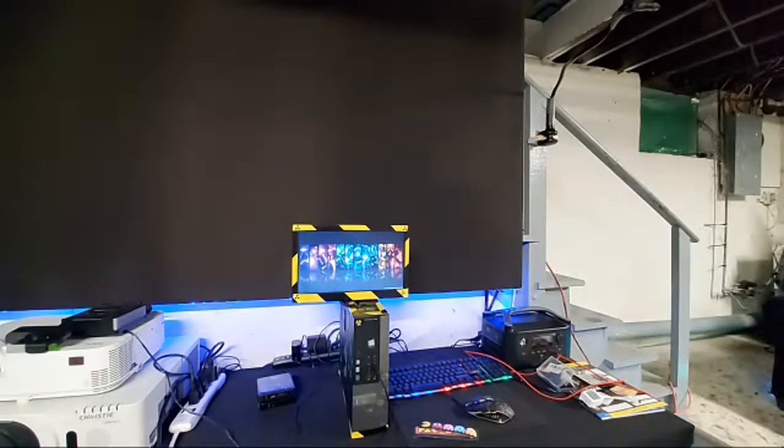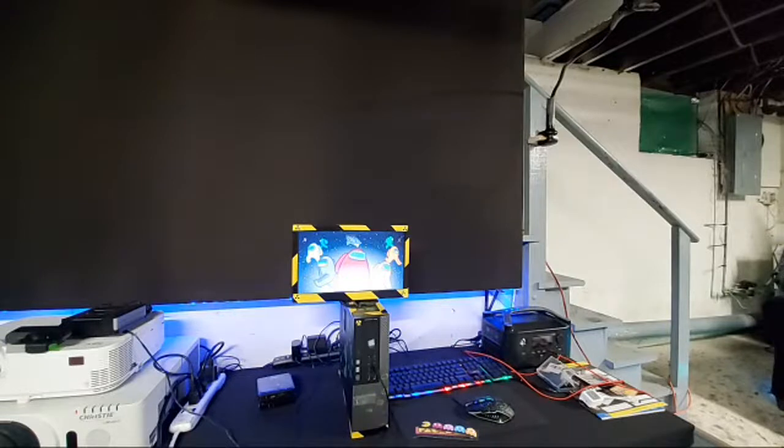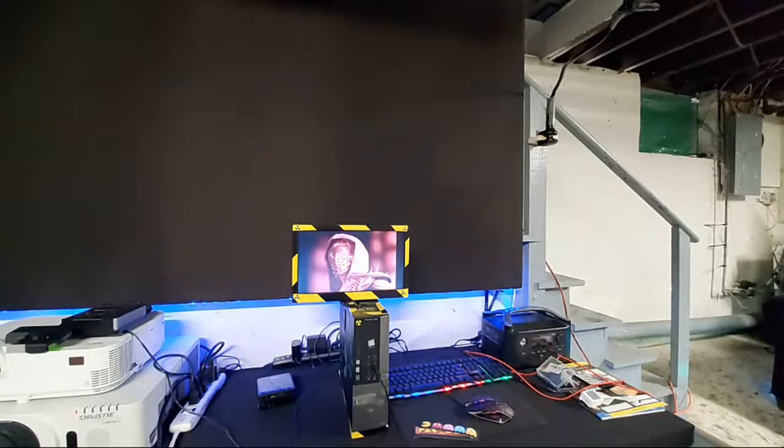So I don't want that dinky line running through the house. I got 100 foot of white heavy duty cable until the electrician can come down and install my outlets. Now my outlets down here are going to be different. They're going to have their own separate breaker, just in case anything trips off, it doesn't touch my box over there, because I'm going to be hooking up some crazy stuff down here. So we're going to have a separate circuit breaker for the two.